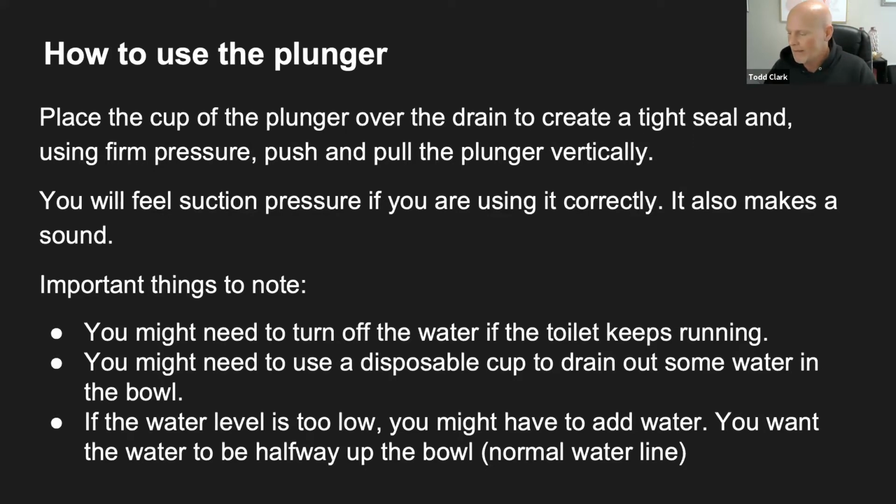And so Mike says that he shakes the handle to make it stop. That's basically what Mike's doing: by shaking the handle, he's loosening up the chain that's usually caught on that flap, and that will make it close.